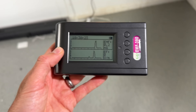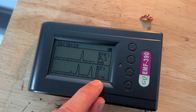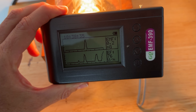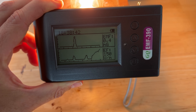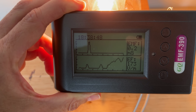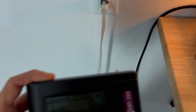I want to actually measure how high the voltages are in the air around me. I have this really cool tool called an electromagnetic field meter. It can actually read the strength of the AC electric field in the air and also the AC magnetic field around me. Let's put it near my light bulb first — we're at one volt per meter here. Put it near a light bulb in my house and we're already getting 110 volts per meter. That goes up to 173 volts per meter change. So there are already hundreds of volts per meter just in regular stuff like this.